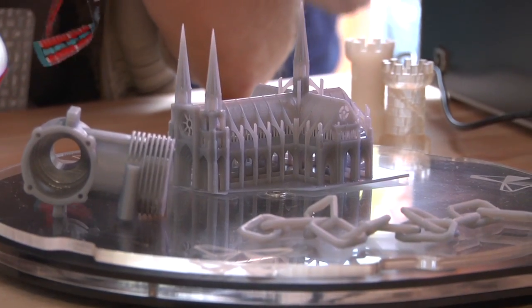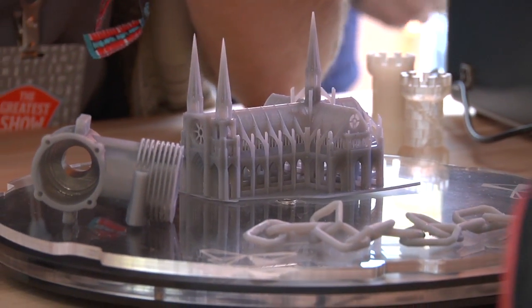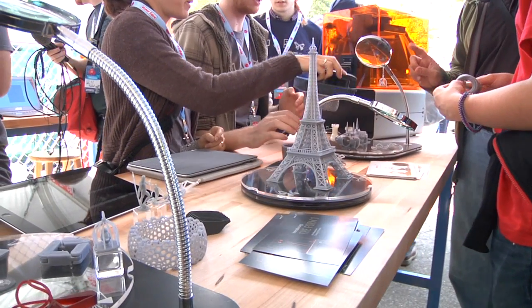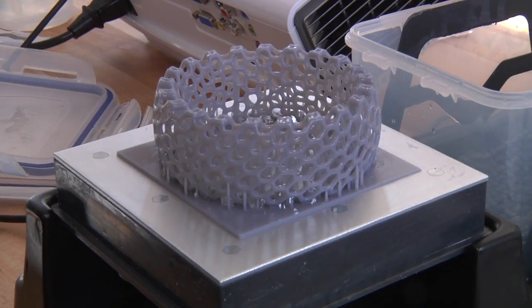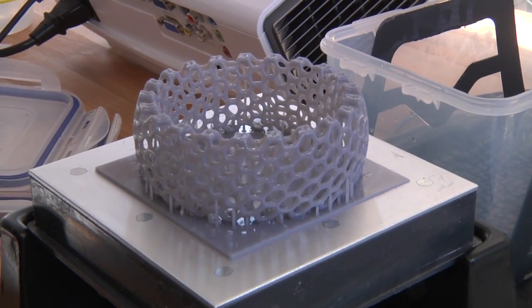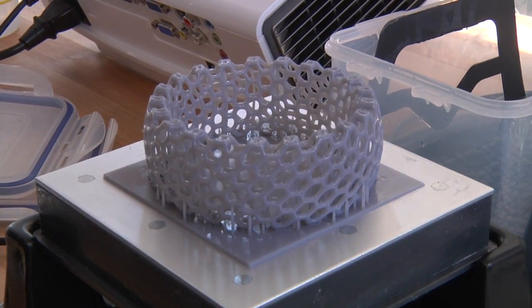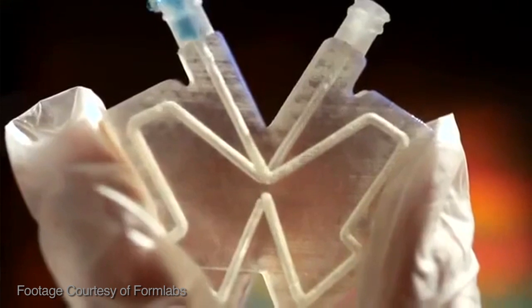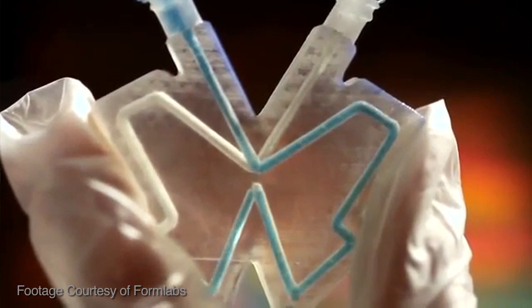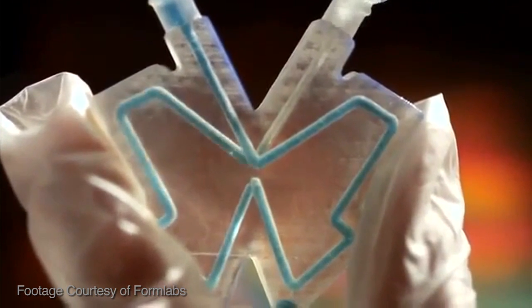What's your resolution, both on the layer and for layer heights? The layer resolution can be as thin as 25 microns, and we like to talk about minimum feature size — the smallest pillars and other features you can have in your part — which can be down to 0.3 millimeters. We can also build cavities inside structures and handle a much wider range of geometries than other machines.